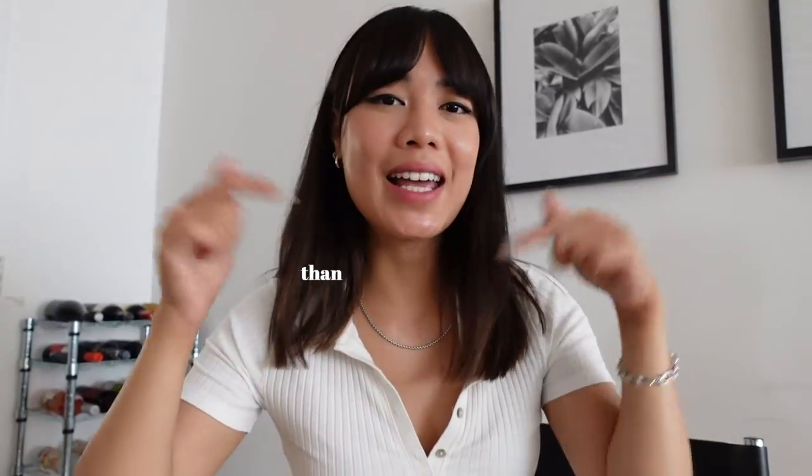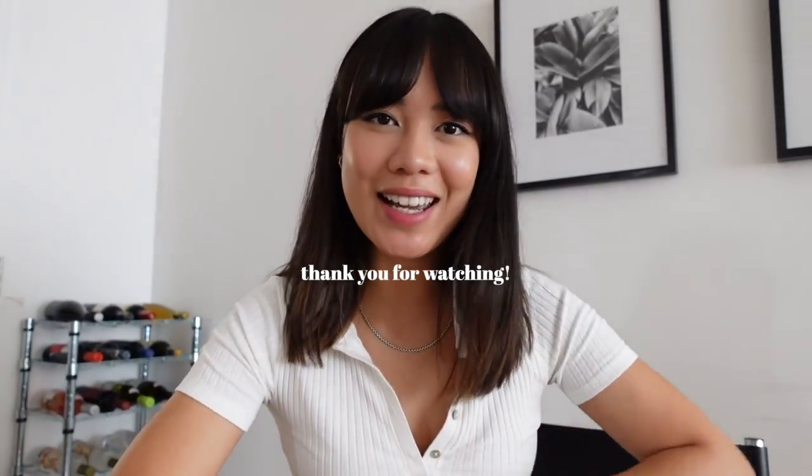Those are probably the only pointers I have - use unsanded grout, and clean the surface really well when grouting. The rest of the steps went pretty smoothly. Sticking the tiles on was really easy, and after cleaning, your project is pretty much done. I'm really happy with how it turned out. I hope you guys enjoyed watching this video and learned something today. If you liked this video, please like, comment, and subscribe, and I'll see you guys next time!